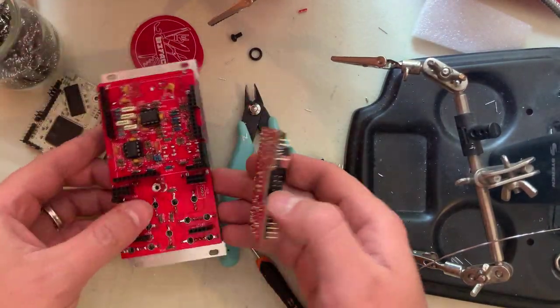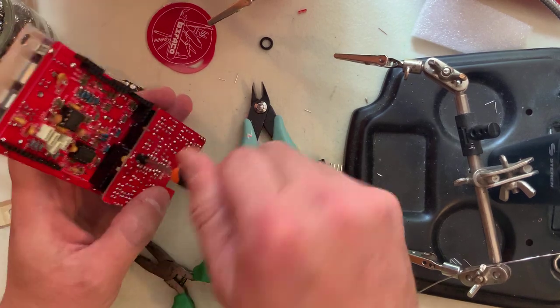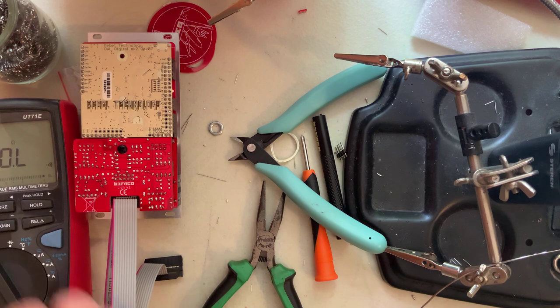If you're having trouble fitting the main PCB with the control PCB, cut short the pot lugs of US9. Now connect both PCBs together. Use the included M3 screw to secure them. And finally, snap on the OWL board. That's it. Check the power header for shorts and plug in to test and calibrate.